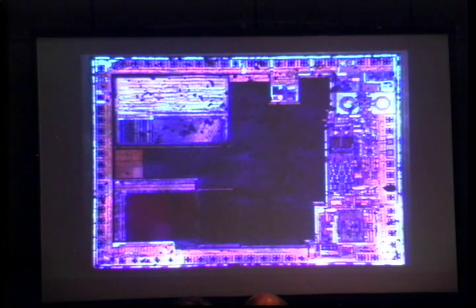There's also a USB-to-serial chip on the dongle, which could have been eliminated and it's not my favorite chip. This is the ChipCon 1110. You've got a computer in the center, some power stuff on the side, and then running the whole length of the chip is a sub-gigahertz radio. The radio is not really a software-defined radio, but it is software-configurable. In the same way that you might process things using a USRP, you can tell this section of the chip how you would like the radio messages to be interpreted, and it will follow along or translate them for broadcast.